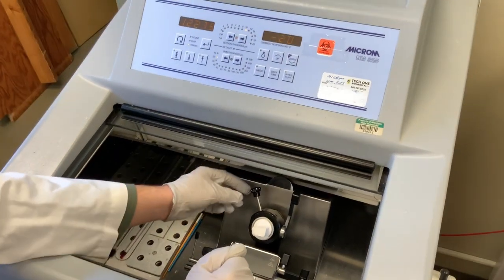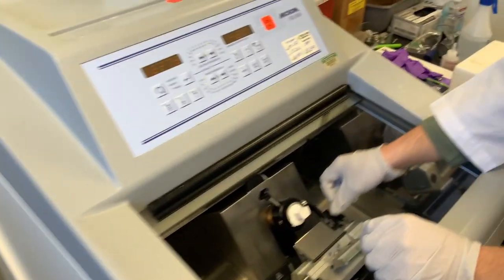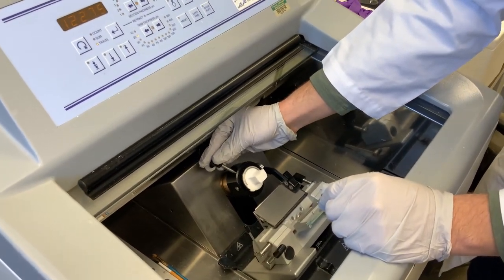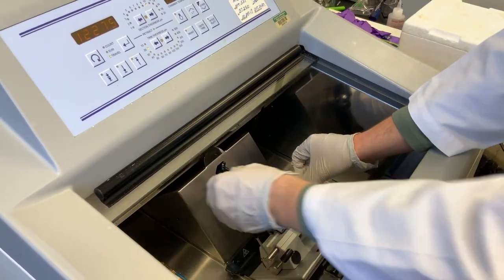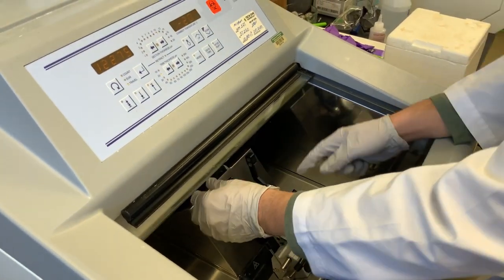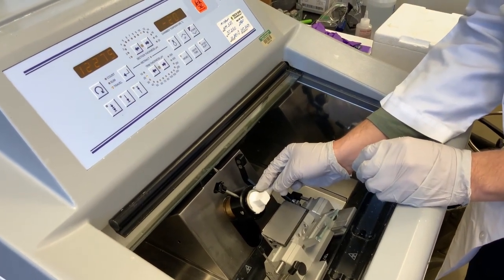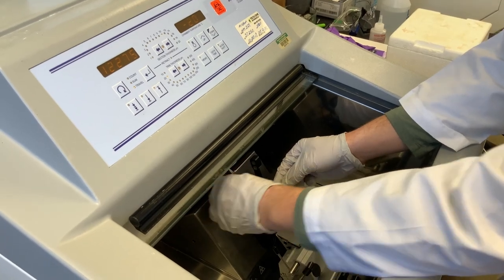At this point, there's another thing you can do — you can undo this lever. That thumb screw now acts as a joystick that allows you to adjust the angle of the sample. If you loosen the thumb screw, you can also rotate the sample in this axis. You just want to get it as straight as possible for whatever you're doing.